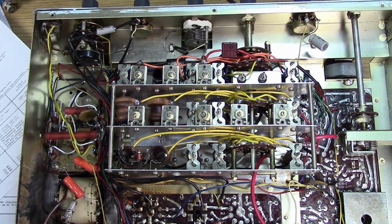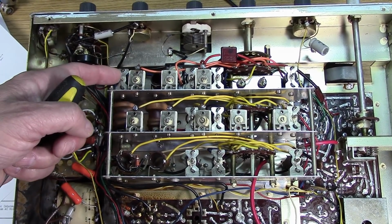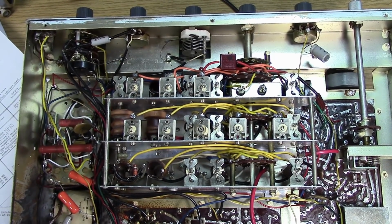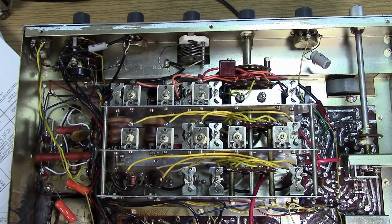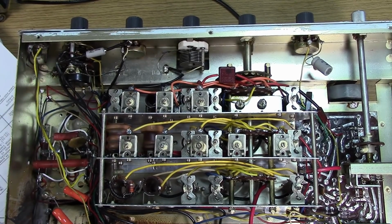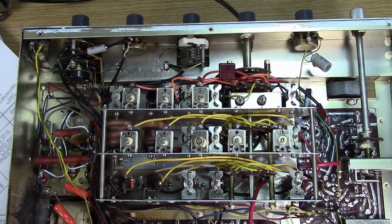You really need to loosen every single control up before you put the bottom cover on. And that's easiest done by just heating it with the tip of your soldering iron on each control. Break that loose slowly. You might need to use a little bit of some kind of solvent there to get the paint loose. If you do not, you will break the ends off the adjustable inductors and capacitors that are piston style because the metal is not great, and you just won't have enough force to break through that paint. Best to do it first, get everything loosened up.